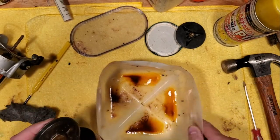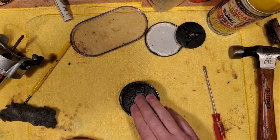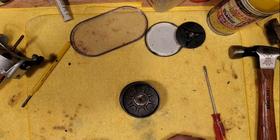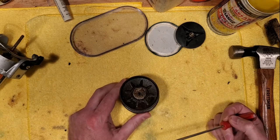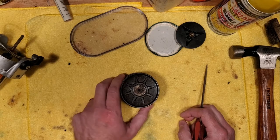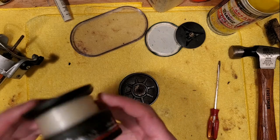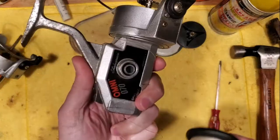We're still going to attempt to clean this up the best we can — take some steel wool to this shaft and try to clean that up. I am a little surprised it's in that bad of shape given the fact that the rest of the reel really doesn't look that bad. But obviously some saltwater or spray got in there and just sat there, and that's what happens. So we're going to tidy up here and get ready to take our drags out.